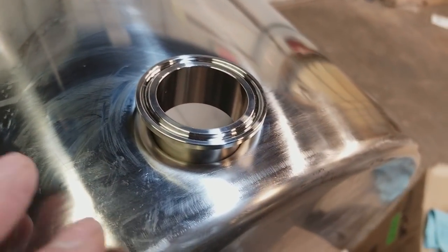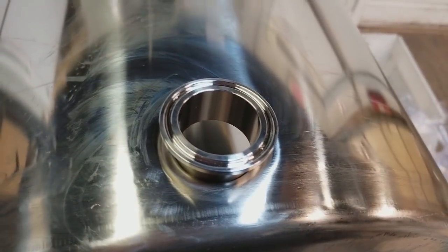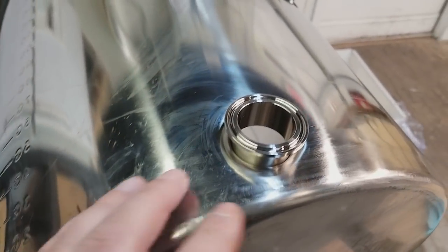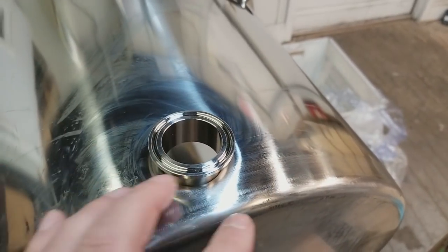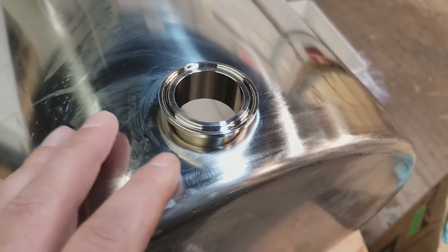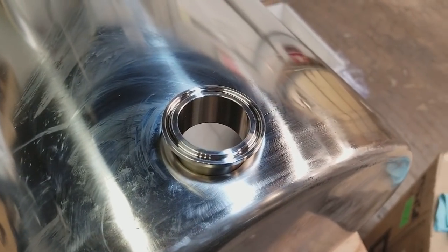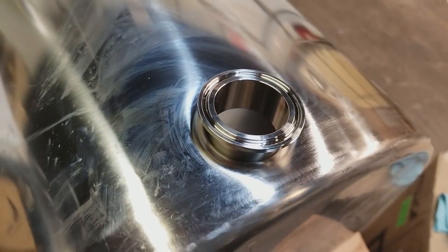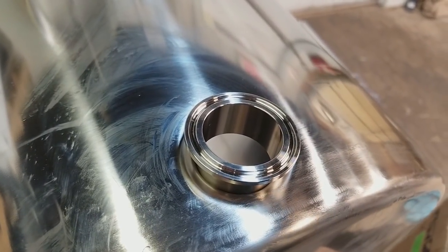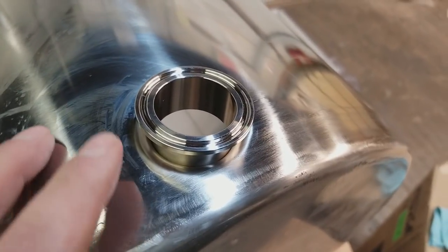Never test for flow when you have the heat directly on the solder — of course it's going to melt under direct flame. You can also try going inside the pot; if you're working with a big 18-gallon pot there's plenty of room to get the torch in there. Try not to focus on any one particular area — keep the flame moving so you're heating evenly. Watch for the solder to start flowing and make sure it's melting evenly all the way around. You can feed some more in off your solder spool. Once everything's nice and melted, if it looks good, leak test it — if it's not dripping you're good.